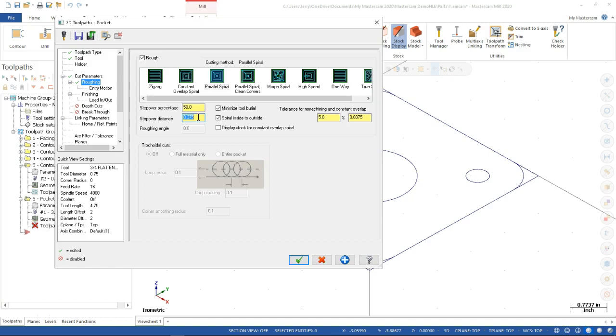Is that one? Oh, 3/4 of an inch deep. So if we're going to go the full depth, if I do a step and repeat, then I'll probably go in 1/4 inch increments and take the larger step over. But if I go to full depth, then I'm going to reduce the radial engagement so that I increase the axial engagement. So if I go deep, then I'm not going to go as much on the radius. And if I go lighter on the depths, then I can increase the radius.